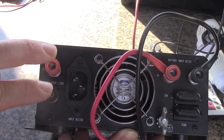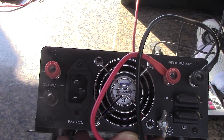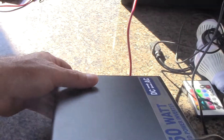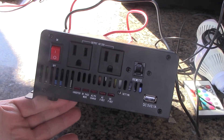You don't want to exceed 25 volts on the solar input, by the way. Most 12-volt solar panels are 18 to 22 volts, so that's usually not an issue with 12-volt solar. This is a very nice fan too, and it never runs — that's the funny part. This thing is so efficient and so well-built that the fan hardly ever kicks in.